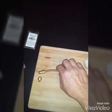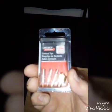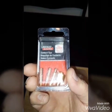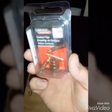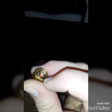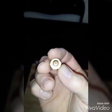That's the whole design right there. This is the actual welder tips from Lincoln Electric and I purchased those at Home Depot — it comes in a pack of 10. When you buy the connectors here, make sure it has the brass fitting that's already built onto the cap, because this thing will just slide right into it perfectly, and then once you tighten it down it's going to lock it down onto the coupler and completely seal it off from any leaks. So the gas will come through that hole.